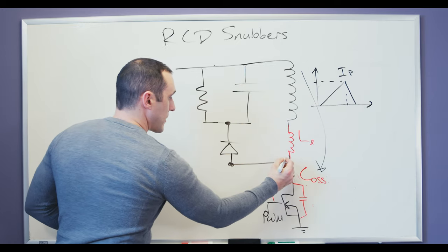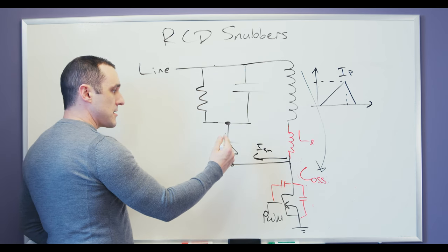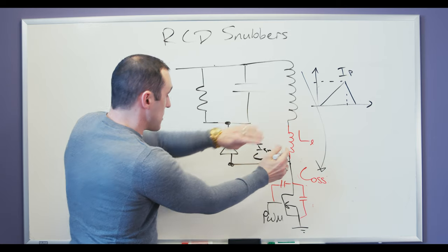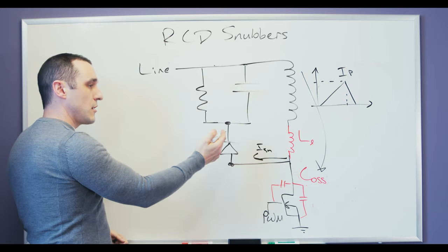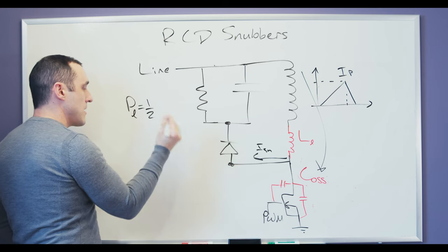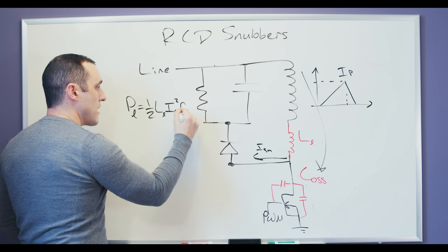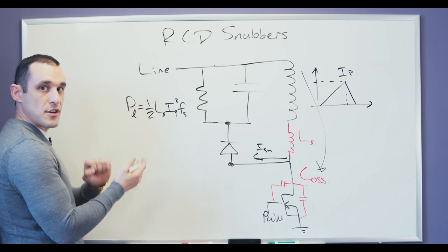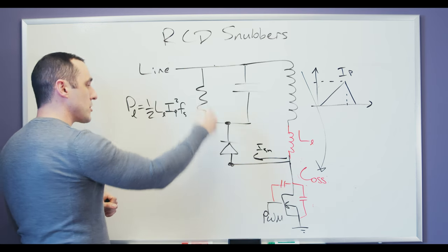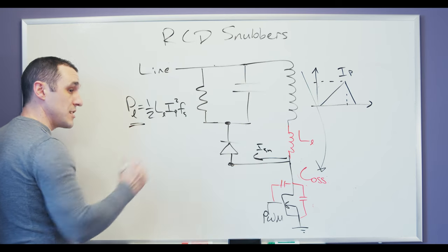During this event, some current can then pass into this leg of the circuit — we'll call that I_snubber. This forward biases this diode. So this power that is stored in this leakage inductance is being released, and then it needs to be dissipated across this snubber circuit. The power associated with the leakage is given by this value: we have our L_leakage, our current squared, and then our frequency — F_S is our switching frequency. As you can see, if we're switching faster on average we're going to be delivering more power to this snubber circuit, so the snubber circuit needs to be designed so that it can withstand this amount of power released from the leakage inductance.